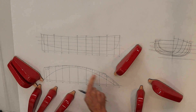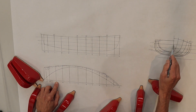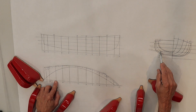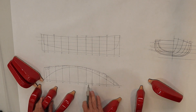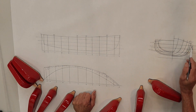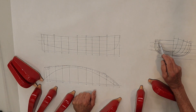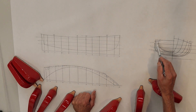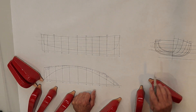The way that I determined these was I basically just went over — so for example, at station nine, I went over from the center line that distance, which is the same as the distance at the water line. What I did was put little tick marks at each one of the station marks and then transferred that information over to the drawing. One of the things about the body plan here is I moved station six over to the fore side of the drawing because station seven was actually beamier — that distance is greater. Now you can see that these are all of the station marks, and this is what we'll need to make a table of offsets for so that we can start lofting the boat.